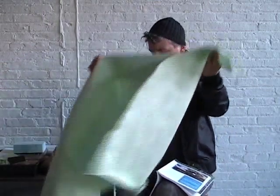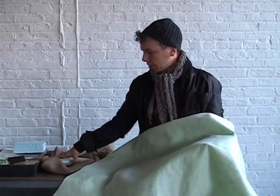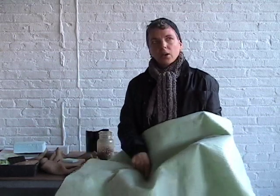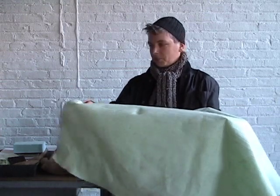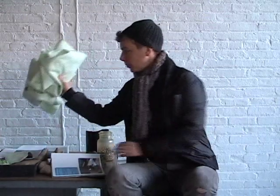Basically, this layer goes over top of your membrane layer and acts as a protection mat — exactly what it says. When you're building out your roof, you don't puncture or step on your membrane and put a hole in it. It's a really important layer. It also works somewhat as a water retention layer and holds a fair amount of water for its thickness.